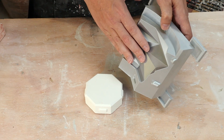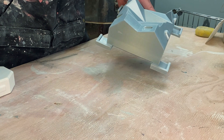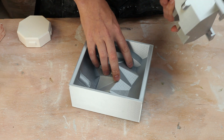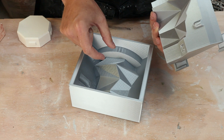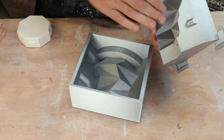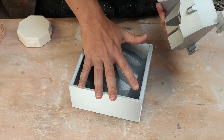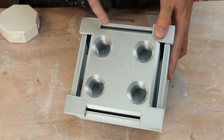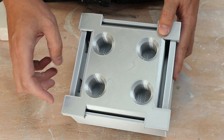So how do I make a plaster copy of this piece? I'm going to use the same process as I did for the bottom. In addition to the piece I 3D printed, I also made a corresponding piece — this will be the form I pour silicone into, and it's basically a mirror of the piece I care about. There's about a 5mm gap between the two surfaces that will give me the thin silicone shell. The silicone will stay in this piece that I'll cast plaster into. These two fit together, and I need to pour silicone into the gap to create the silicone sleeve.